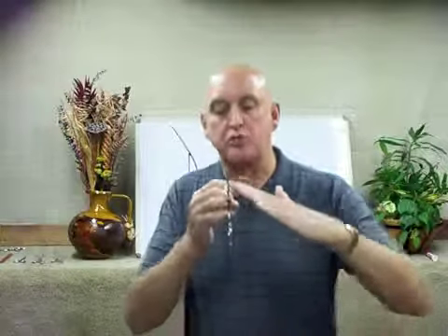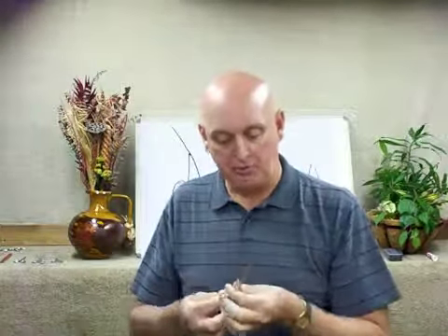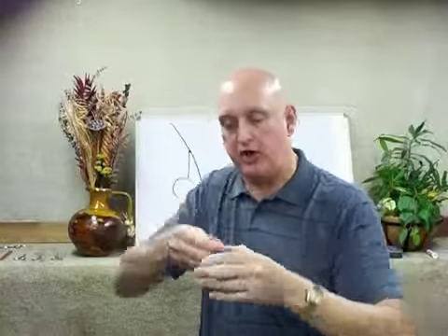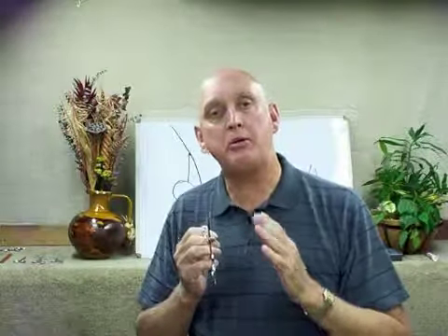On the outside of the shear, some shears are made with a bevel at an angle, anywhere from 15 to 20 degrees. Those are usually the shears that have a little serration — little teeth on them. And then some shears are a little steeper, and a shear like this one is called a hamaguri edge — the edge is really steep. It's put on with a belt sander with a little give as the belt runs around, and they push that on there. The steeper the angle, the sharper the shear will be because you've got less metal on the cutting edge — it's a lot thinner. The flatter the angle, it's a beefier scissor, more durable edge, but they won't cut as good. So there's a trade-off involved.